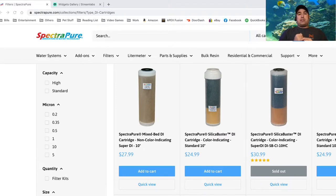After a couple months, those chambers are going to crack. And I can tell you right now, and Producer Reef, you could tell me, if you are running your booster pump before your entire system, or anybody out there, tell me if you're getting any type of leaking from the unit whatsoever. And I mean just a small amount. Go look and see if you have any salt creep, because that's the problem, is you're putting too much pressure into the canisters. Okay.